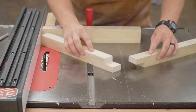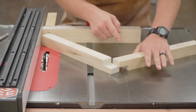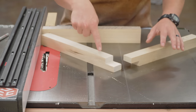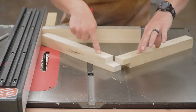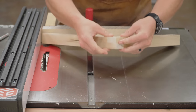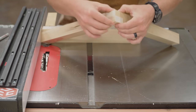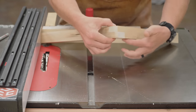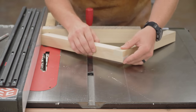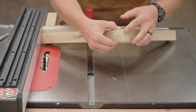You sneak up on the height until these are perfect. What I call perfect is: if they're laying on the table and you push down on one, the top one moves the other board — there's enough friction. But they're also at the perfect height to just seat properly. Once together, there will be no gaps all the way around, and both top surfaces should be nice and perfectly flush. That's how you know the blade height and width are set properly.